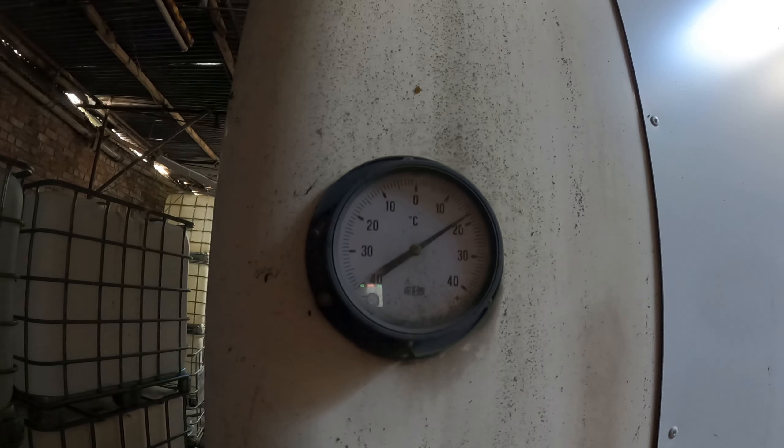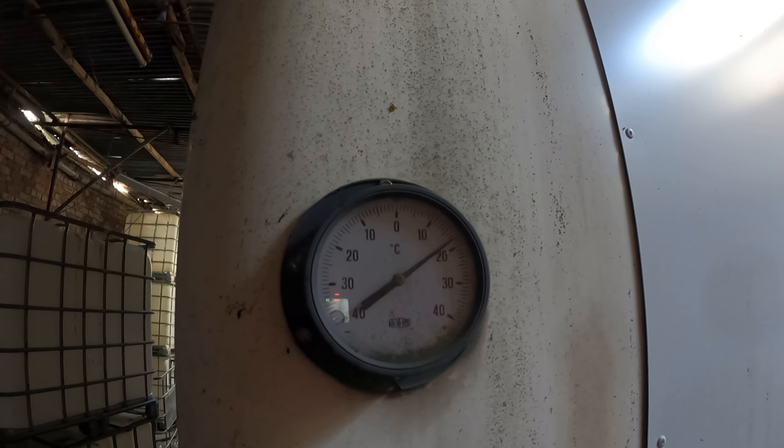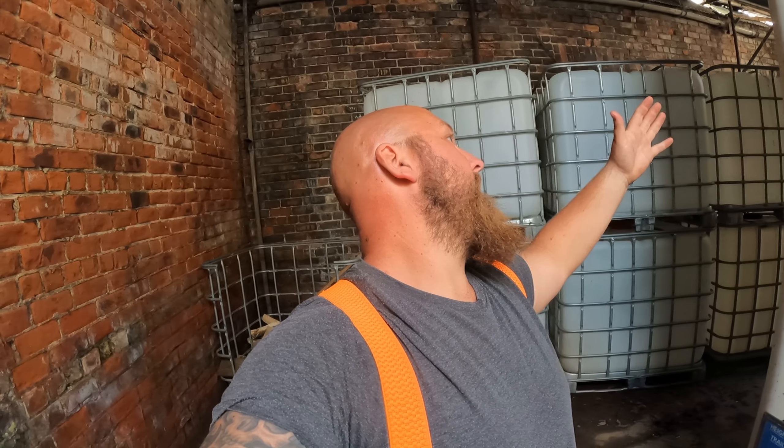The joy with this as well is it's got a temperature gauge fitted onto the refrigeration unit, and it's actually saying it's roughly 17.5 degrees. It's got no sun on it, no heat in there, and it's already at 17.5 degrees. The heater I'm going to use can do plus 60 degrees above whatever ambient temperature is. So if it's already 17 degrees, that means in theory we should be able to get to 77 degrees. But I think if we could get to about 60, 65, maybe 70 degrees tops, that would be fantastic.